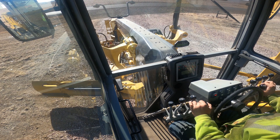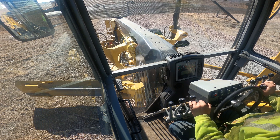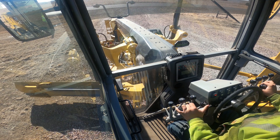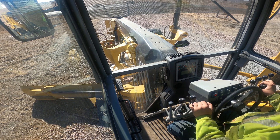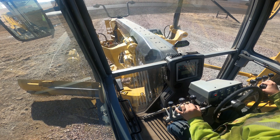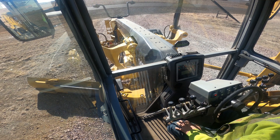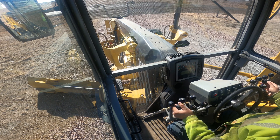I'm going to show everybody how I pull the saddle pin on my 140 with the antler rack here. I like leaving my circle side shift in the middle for the time being. What I'll do is I'll put each corner down here, kick it in the float, reach over on my right side, and retract my pin.